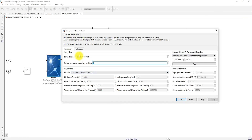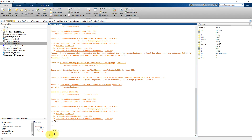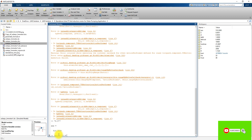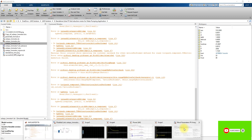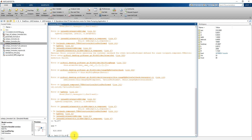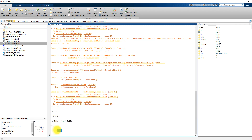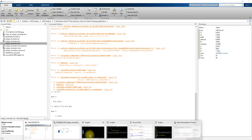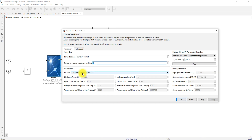We also calculate the number of parallel strings. For a 5 kW design, using 2 parallel strings: 7 × 72.9 × 5.69 × 2 gives a power rating of approximately 5.8 kW. So the total PV array is rated at 5.8 kW, and we are using a boost converter.